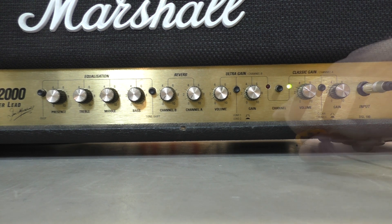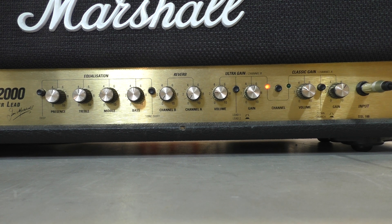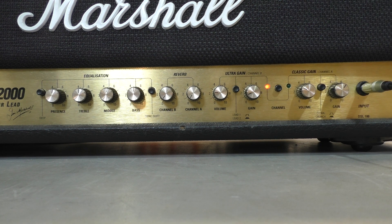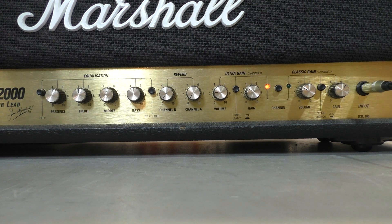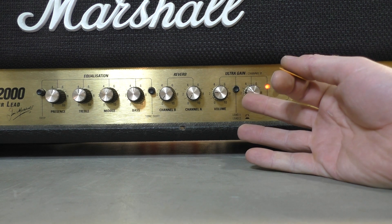Moving to the ultra gain channel. So that's the tone there being fed into the overdrive stage — that's the tone shaping the amp sees before overdriving. All the bottom end is gone, and of course that's the only way you can make a non-flabby distortion. When you distort it the sub-harmonics come back in later anyway.